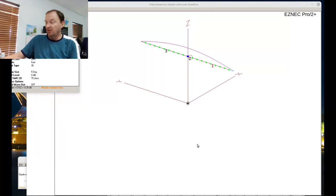The upshot of that is if we use our formula to figure out the length of a half-wave dipole, because we have two ends, they're going to make this antenna appear longer than it really is — we have two high voltage points. The actual ends of this antenna extend out into the ether a little bit and make it appear longer than it really is. It's going to be too long by the formula 468 divided by operating frequency. So we'll use that formula, throw it up in the air, and find that instead of being resonant at 7.2 megahertz, maybe it's resonant at 6.9 megahertz. No biggie — just start trimming it until we bring it up to 7.2 megahertz where we want it to be.